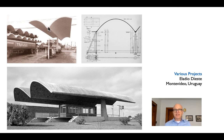We're taking away most of the weight out of a cantilever beam that would ordinarily be that deep — all that saved dead weight allows for either a greater span or greater loading. There's a difference between the architectural module, which looks to us like a vault, and the structural module, which Dieste sees as a gull wing.